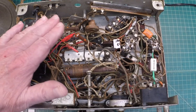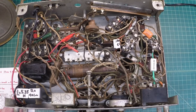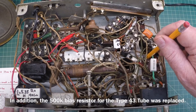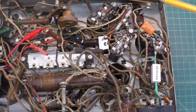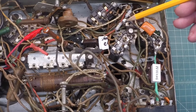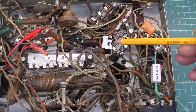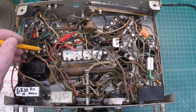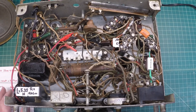Moving along — I checked some of these resistor values and they're about 25% high in some cases. Some that were critical to the operation of the radio that I had to replace are over here in this section that feeds the 75 tube. My voltage to the plate was extremely low and this series of resistors had to be replaced. You'll also notice I have a capacitor tacked in from the center point back over to here. The actual circuit it should be attached to runs from this point back to here, going back to one of these bakelite blocks — right here. And that capacitor internally is shorted, so that's a problem as well.